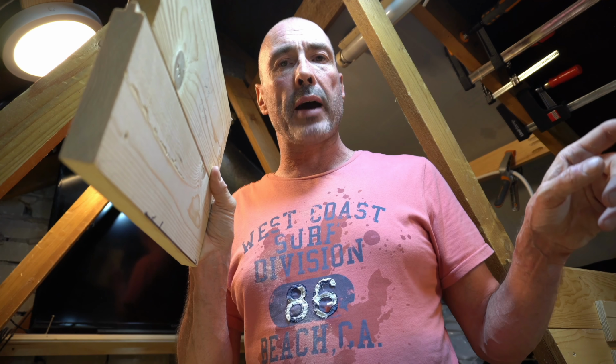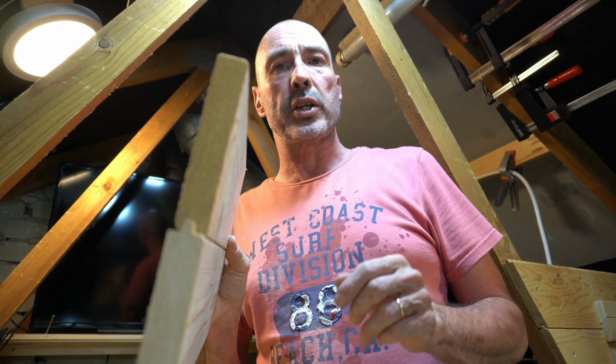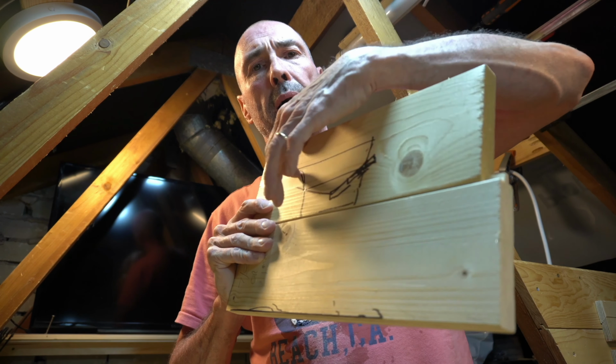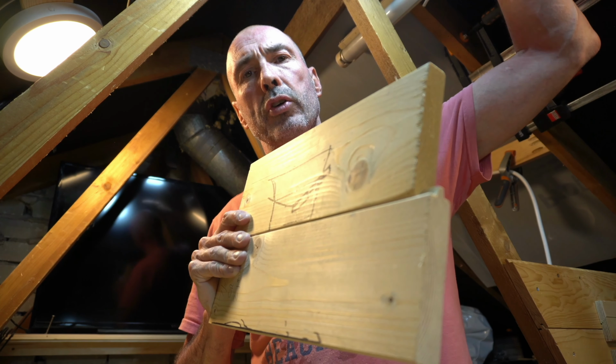There are 5 stages, which means the whole thing's going to be finished about 3 foot tall, 900 millimeters tall. As they sit on the angle, the inside dimension at the bottom has to be equivalent to the outside dimension at the top, so they actually slide on top of each other. The stage above sits down about 1.25 inches, so basically they lock on top of each other.